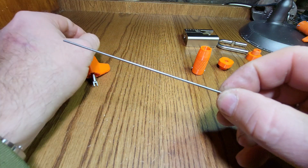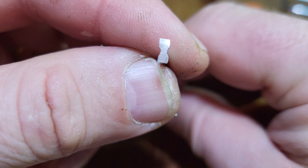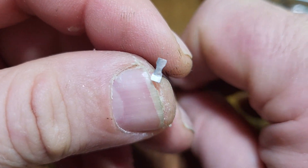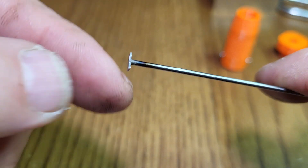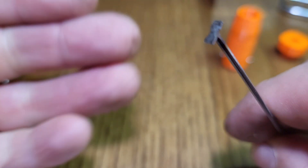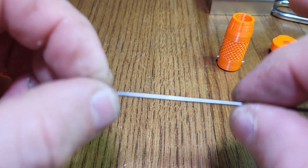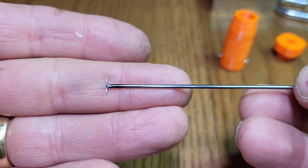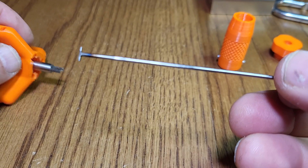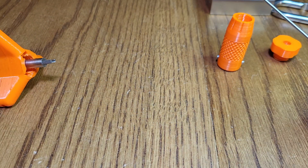The picking tip is an ejector pin. I've profiled it so it's got little divots in the middle so it slots through some of the profile discs - a little bit of finishing to do on this. All I've done is ground a standard ejector pin down into a flat profile on a belt sander, hence the horrible state of my hands. That's really all there is to the tip - it's a 1.5 millimeter shaft. Talan's parts page shows a 1.6 millimeter ejector pin but I didn't find any of those. Since I was making my own tools, 1.5 millimeters suited me better as I have a 1.5 millimeter drill bit.